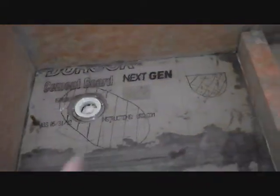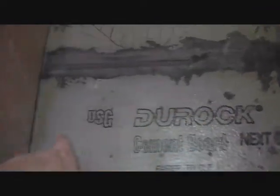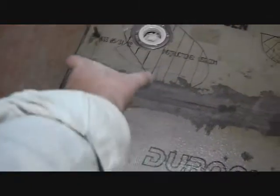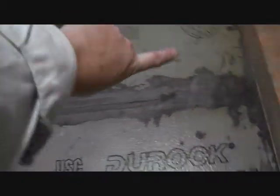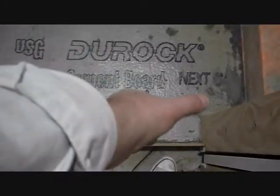So, also, actually after the cleaning, but before the primer, just before lunch, I laid out the radiant floor heat mat. I wrapped them all up, laid it out, got a pretty good final idea of how to lay it out. You cut the mat, the fiberglass mesh matting in between. You don't cut the orange wires, and you can lay the mat out like that, and then cut it, then turn the mat, come back, cut it again, turn the mat, and we'll go into there.